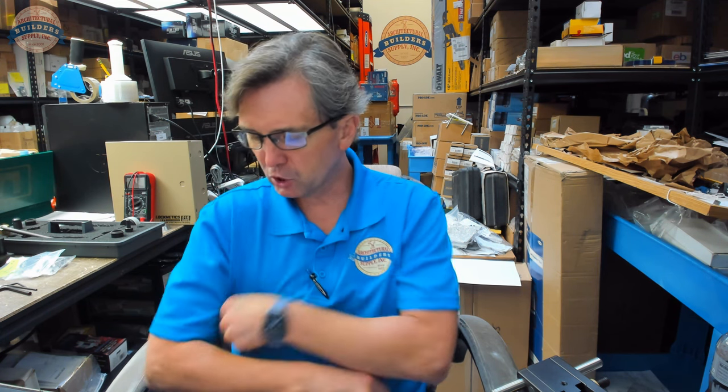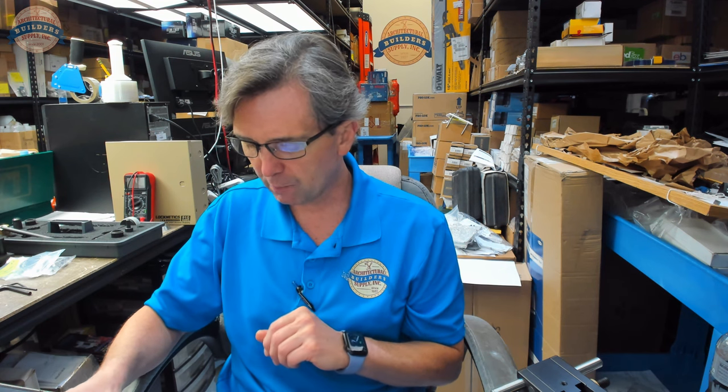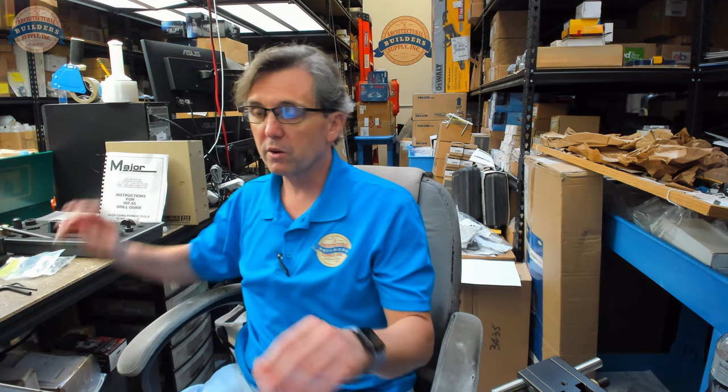When drilling a 5-inch backset crossbore, you will need to use one of the longer spade type bits. Yeah, we've talked about that, the 1-inch long spade bit for the 5-inch. Once you have drilled the required function holes, complete the job with our marking and locating tools, making your job faster and more professional. Okay, let's talk about those marking tools.